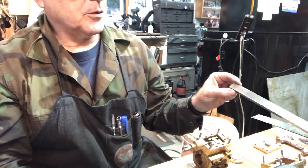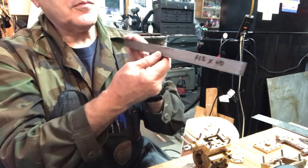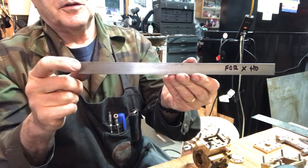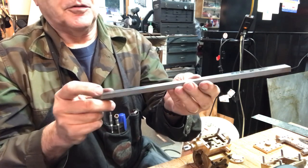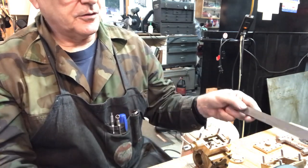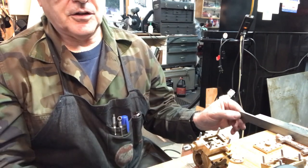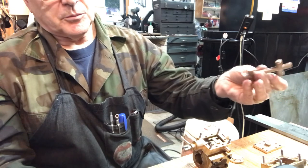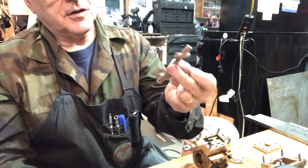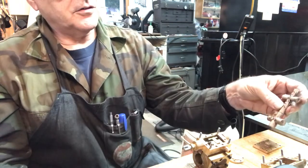The final part of this week's episode was making a little steam relief inside the internal registers of the cylinder covers themselves. Speaking of McMaster Carr, I got a nice care package. I had saved up a whole bunch of stuff to order — they have some of the really nicest cold-rolled steel you could ask for. This is what the crossheads will be made out of: 5/16ths by 3/4 inch by a foot long, very reasonably priced. I'll be working on the crossheads next, and I got material for the guides and valve guides. I also got some copper pipe for the cross tees — the intake and exhaust for the cylinders — which I purchased after buying the kit.